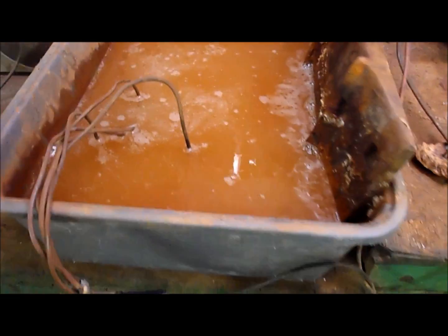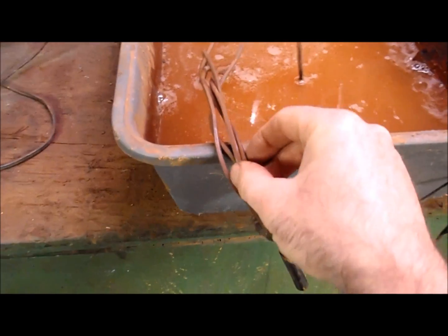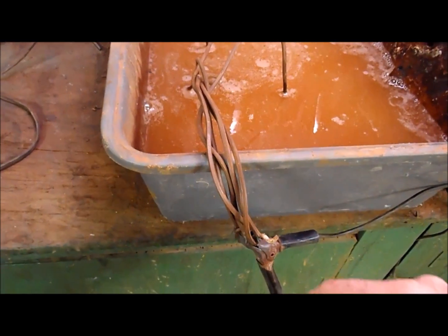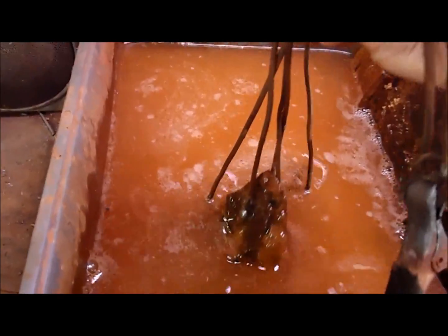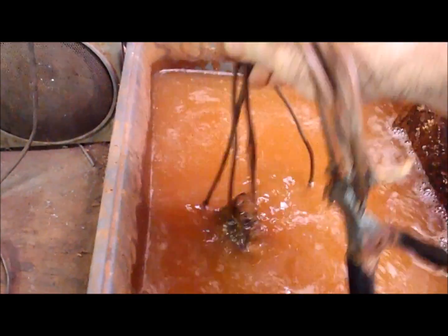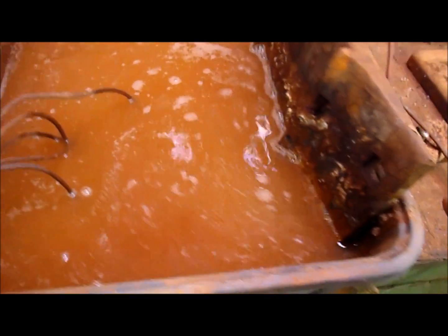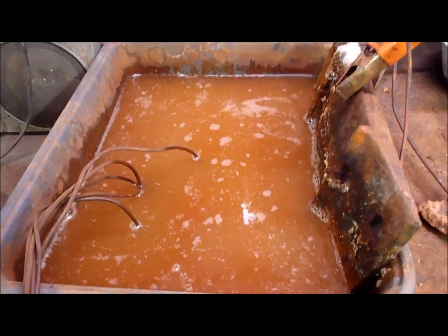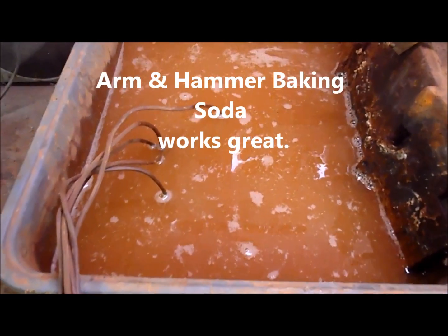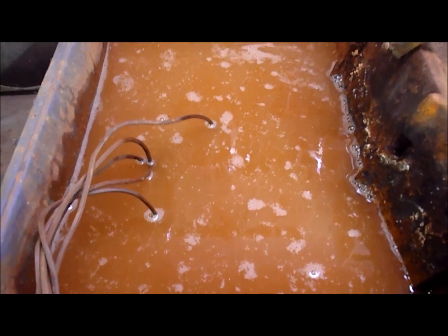In here I have my cannonball fragments. I have the negative hooked up to the fragments and then split off into a bunch of different leads — five different leads. It's just an electrical cord cut up into little pieces and stripped down, so it's really cheap. Here are my fragments; I just put them in about an hour ago. You can see they're getting a little bit black on the edges. You want to make sure they're completely submerged in the solution, but you don't want them to touch the plate because if they do, it won't work. In the water, all I have is fresh water from the tap with some baking soda sprinkled in. For this size container, maybe half a cup — but if you get the bubbles and the water starts to move, you have plenty in there.